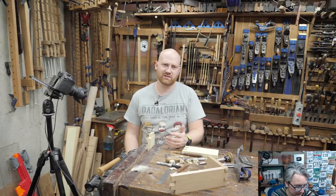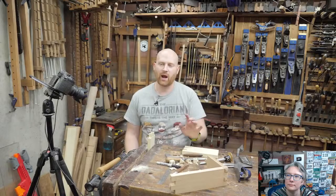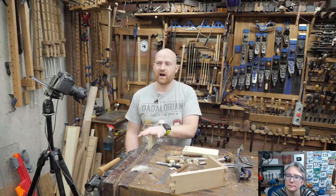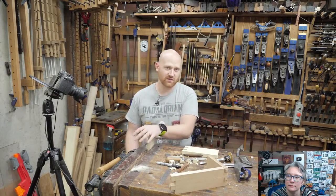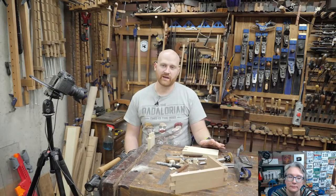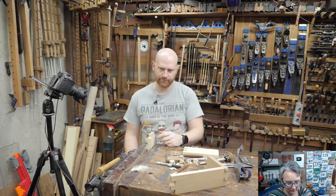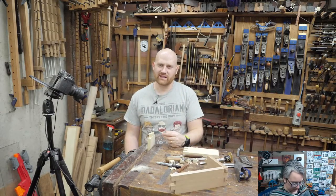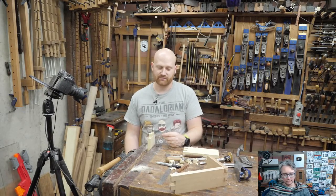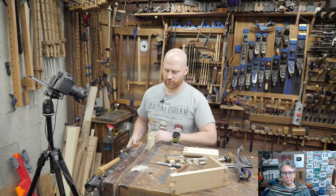As long as you clean the wood and you've sanded it, it's fine. Don't worry about it. The problem comes with hide glues. They have a little bit of a problem with it. But most PVAs aren't going to have any issue with it as long as there's enough clamping force. Epoxies aren't going to have any problem with it at all. And if I have any slight fear about that, it's epoxy for me. And so the myth really comes from the history with hide glue. But for most instances, unless you see obvious oil on the surface, it's not going to be a problem. So don't worry about that.